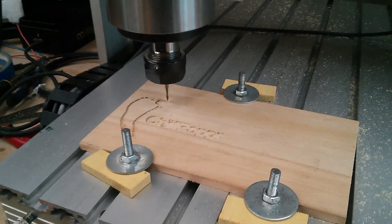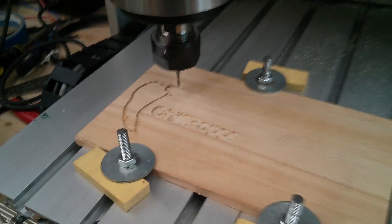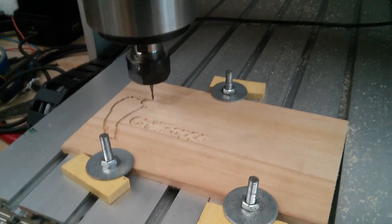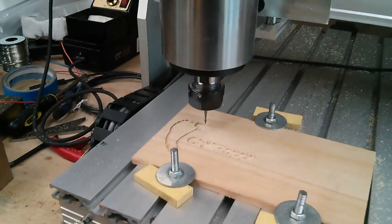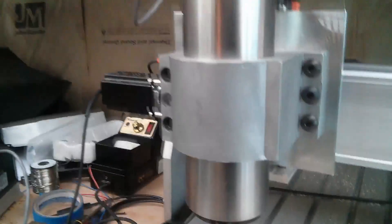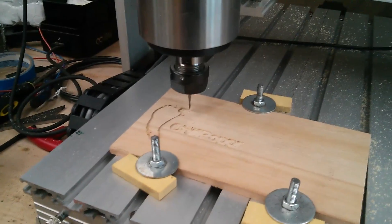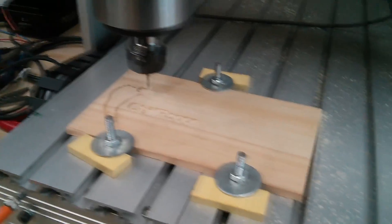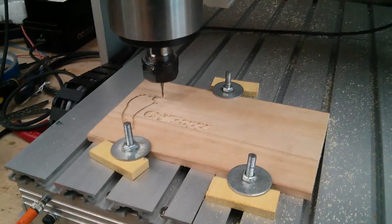This is by far not where I want to be with CNC in the next year or so. But it's working and I'm learning things — it's a pretty cheap way to get started. I'll eventually have to move away from the TinyG and into Gecko Drives or something else so I can get more current. These are three and a half amp motors and we're limited to about two and a half amps and 30 volts — I'd really like to be running them at probably double that to get a bit more speed out of them. But for now it works, and if things take a little longer to get done, that's fine. Alright, I guess that's it for today. It's a good day's worth of progress. I've got a lot of work to do to get this into a really usable point, but stay tuned and we'll have some more updates later.